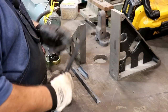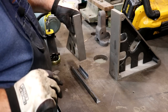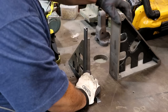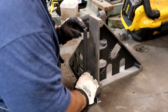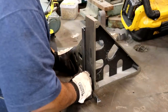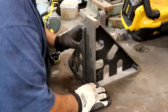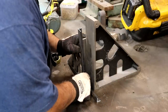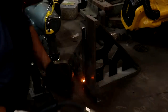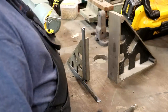We're going to set this up. We basically want to weld this upright right about there. I've got a little piece of metal for a square to sit on to help get it lined up straight up and down, and I'm also going to use another square behind it to get it square in the other direction. There's a mark on there where I want it welded. It looks good — we'll tack it first, and then we should be able to weld it.